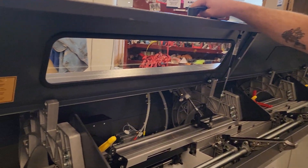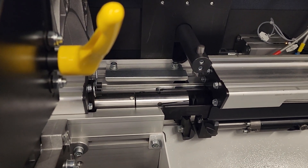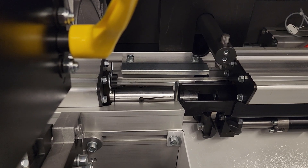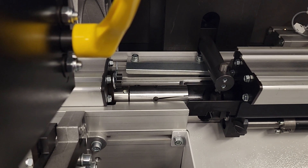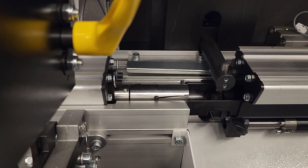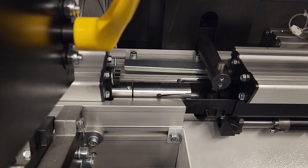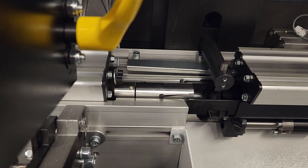We're going to look inside here. Typically what happens is during the bar press upon portion of a bar change, when the grippers are closed and the pusher is pushing onto the back of the bar, for some reason it can't reach a position to satisfy it to allow it to continue. There's a parameter in the bar feeder that tells it the pusher has to reach a certain position in order to be satisfied so it can continue, and if it can't reach that position you get the alarm 'press upon not correct.'